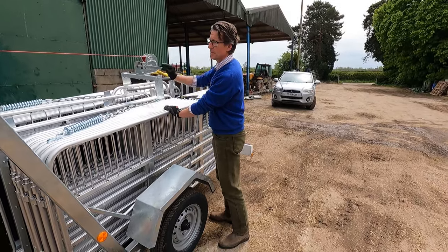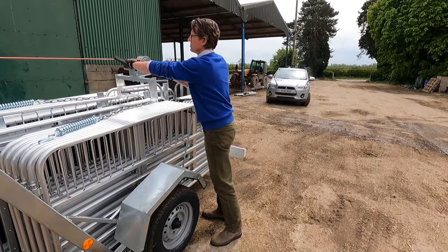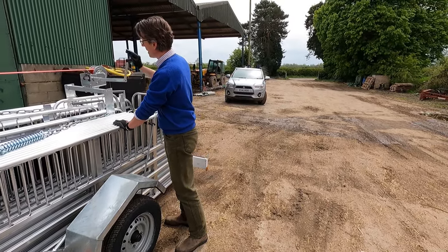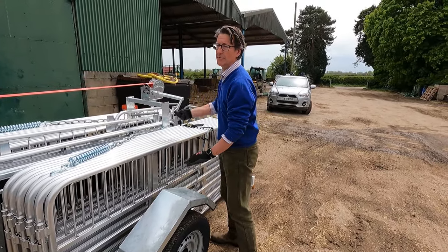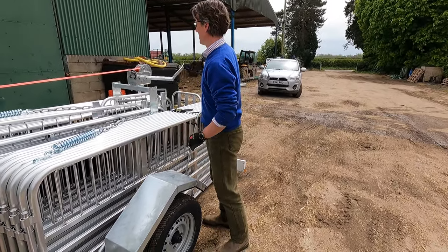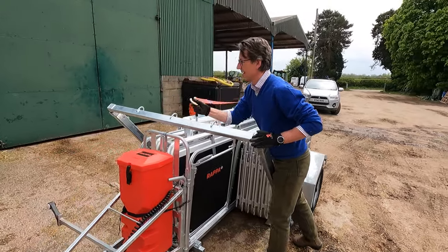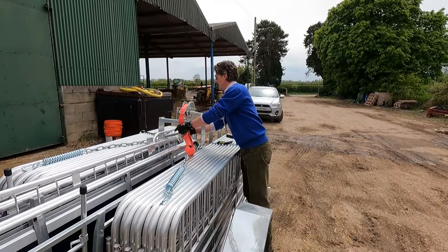It's a few turns because we've made on purpose a highly geared winch so that we can use a strop which is very tough, but also so that it's dead easy to wind up at the end of the day. With a lower gear you'd find people jumping on there trying to wind up because it's getting too hard - you won't have that problem with this winch. My advice is to not wind the strop back in again - take it off and wrap it around the winch.